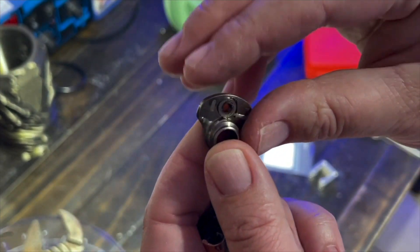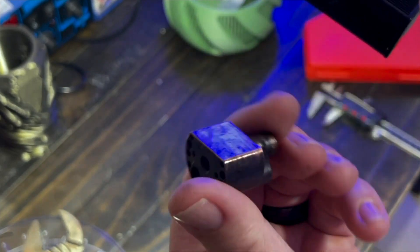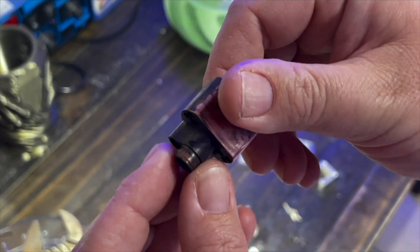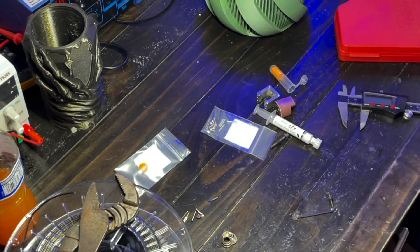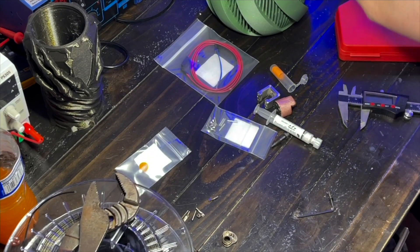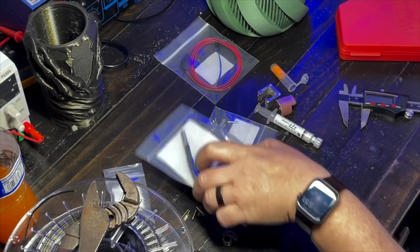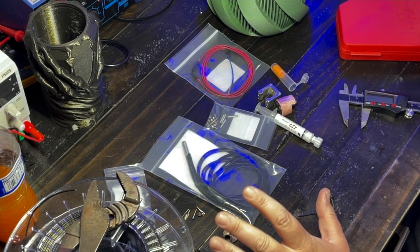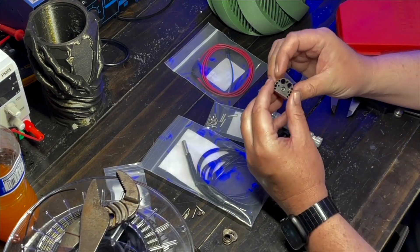I have another video on my channel that shows how to rebuild a Magnum, and I think we're going to be the first to do a Magnum Plus. This is a beta unit — that's why there are no markings or coating on it. We're going to need some thermal paste, a new thermistor, and a new heater cartridge. When you put this together you have to decide if you're going to do one heater or two, and basically what electronic components you're going to put in this hot block.